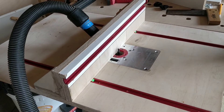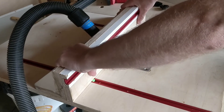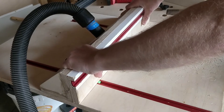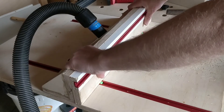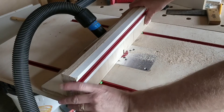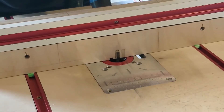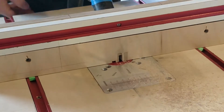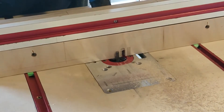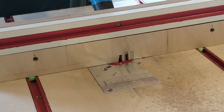I need to route two holes in the jig with a six millimetre spacing. After the cut I realised that I really want to use the jig the opposite way round so that I'm pushing the workpiece into the router bit rather than pulling it. I could just move around the back of the fence but then the emergency stop button wouldn't be accessible. So I fill the holes and start again. I've offset the jig by 12 millimetres using two pieces of the six millimetre locating pin I built earlier.